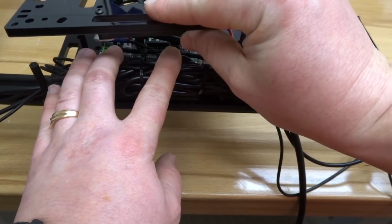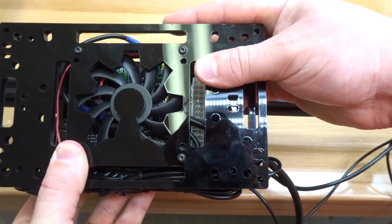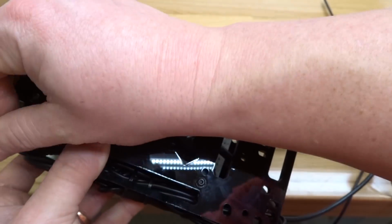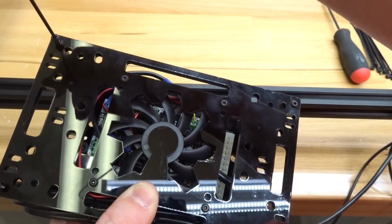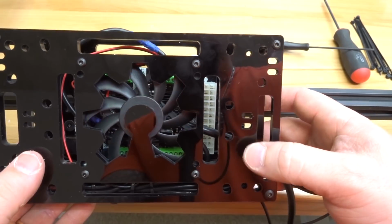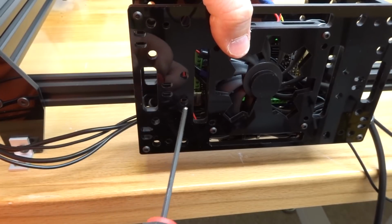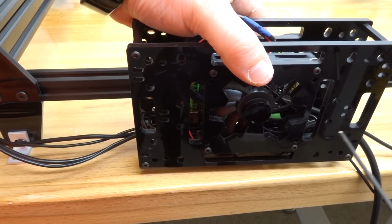And taking our top plate, I'm going to seat this on top of the bottom section. So once you have the plate on top, let's go ahead and use our additional screws that were left over, the M3 20mm screws, and we're going to go ahead and tighten this down. Okay, so now that we have this encased, we're going to use these 2 portholes to tighten this down to our 20x20 extrusion. So let's go ahead and use our M5 ball driver. So here on the left side of the machine, I'm going to mount this into place. So as you can see, I'm using the portholes that were designed on this plate for this purpose exactly.